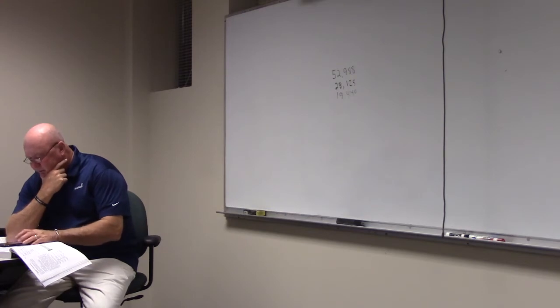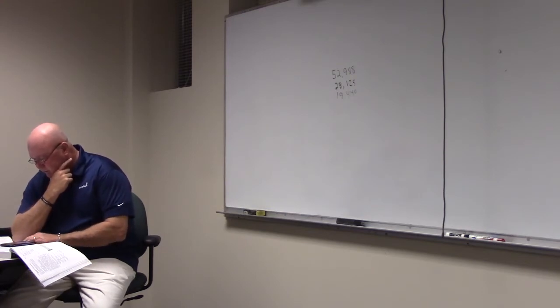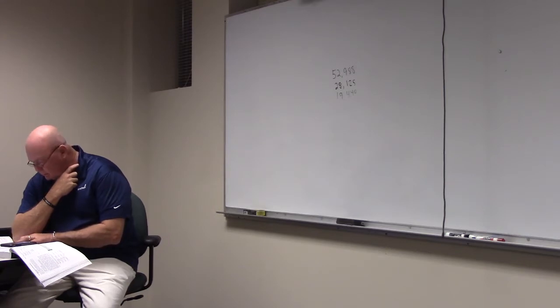Well, let's see about column C then. You see what it says there, note 3? Okay, let's read note 3. In lieu of using column C, it should be permissible to add the nameplate ratings of all the household cooking appliances over 1 3/4 kW and not more than 8 3/4 kW, and multiply the sum by the demand factors in column A or column B for the given number of appliances. Where the rating of cooking appliances falls under both A and B, the demand factors for each column shall be applied to the appliances and the results added together. So we can do that.